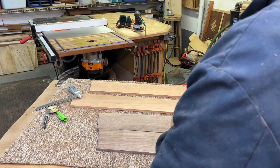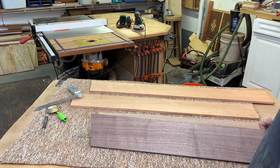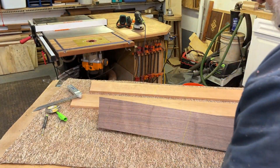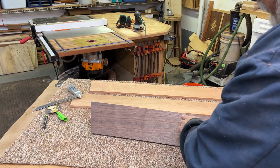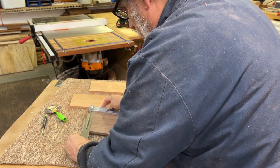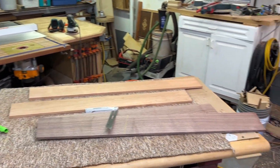So this is really an experiment — I've never done this before up until yesterday. I want to make sure I get this all right because there are a lot of angles, and you've really got to be careful about where you have the bottoms and the tops of these things. I've cut a 10-degree angle here and measured over 16 inches, because the front and the back are going to be 16 inches. Then I drew a line with the sliding T-bevel, matching that 10 degrees over here. This gives me the reference line so I can cut these on the chop box.